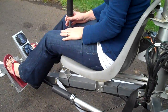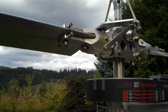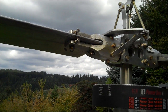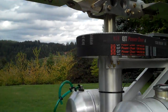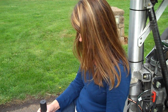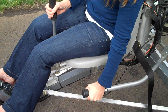Now down here, with your left hand, reach down and lift up that lever. Just pull it up and look at the main rotor blades as you push it up and down. So as you lift up, you're taking a bigger bite of air. As you do that, it's going to drag down the engine. Notice on that grip there, you've got a motorcycle-style twist grip on the collective control — and that controls the engine RPM.